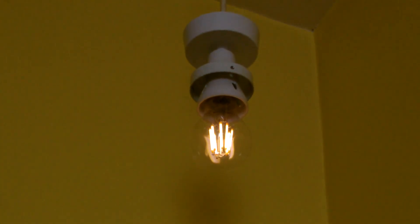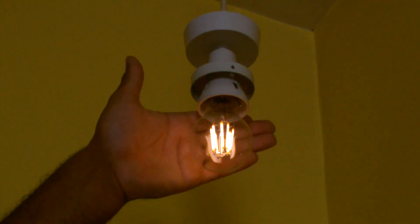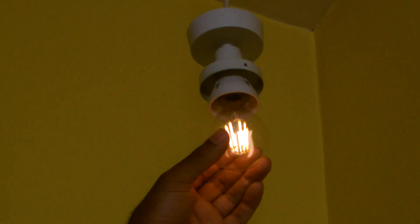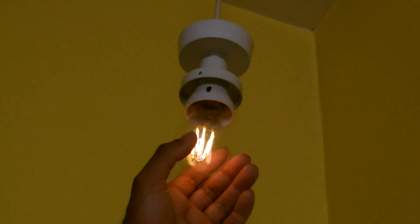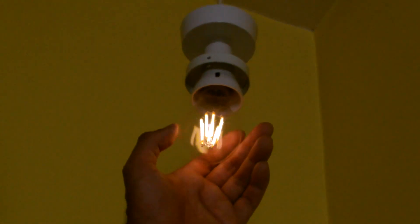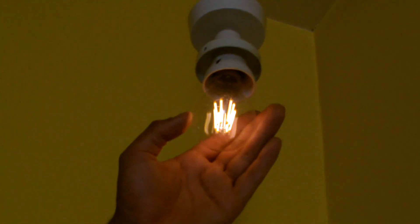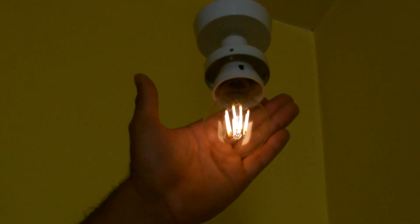This is a video on a strange aberration which you can find sometimes with LEDs. This is an 8-Watt Bond Luxe Dimmable LED. It is unusual in the sense that it doesn't have any sort of circuitry that I can see inside it, such as a smoothing cap, or a resistor network, or the various things that you often do see in LEDs. You'll notice that even in the off position, it's lit — dimly, but still lit.